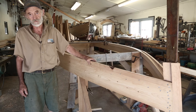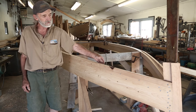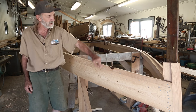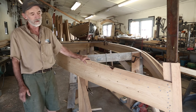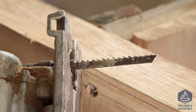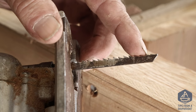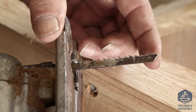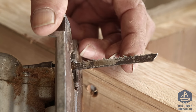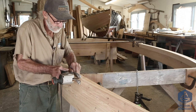The first thing we'd do today is to trim off this little bit of excess plank that hangs down below the chine log, and get rid of this imperfection — this knot and the one on the other side — and you'll get a real good look at the profile of this boat at the chine. I'm going to use a reciprocating saw because I think this is the easiest way. I've ground the set off the teeth at the very bottom end of the saw blade so that it can't cut the chine log in any way.